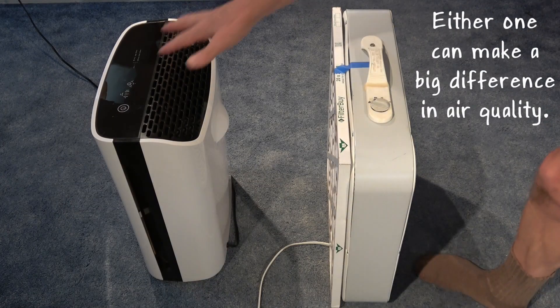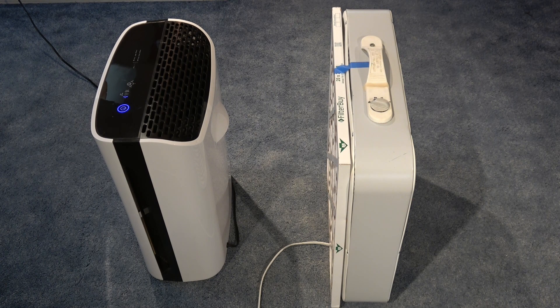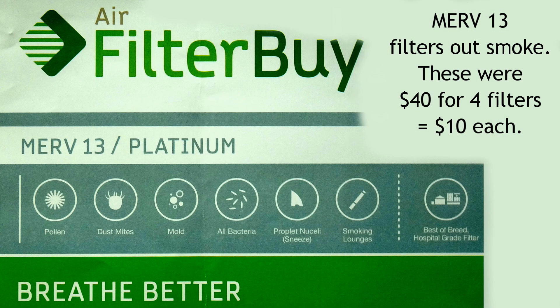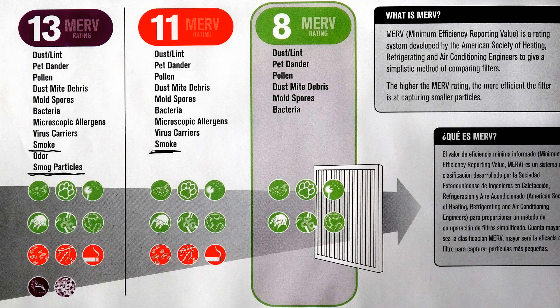The air smells really good in our house whether I run the HEPA filter or use a MERV 13 on a box fan, even when it's really smoky outside. The filter should be at least a MERV 13 to filter out smoke particles, which are very tiny — from 0.2 to 3 microns. A micron is a thousandth of a millimeter. Some MERV 11 filters claim to filter smoke, but since smoke particles come in a range of sizes, a MERV 13 should catch more of them than a MERV 11.